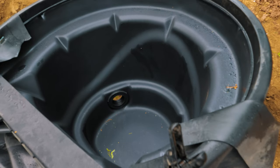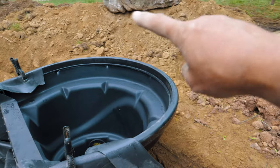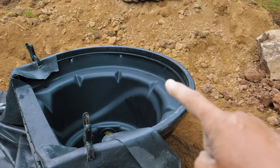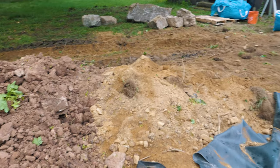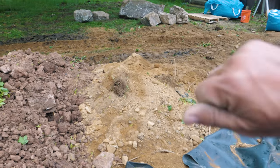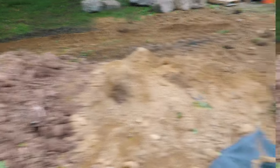How we're going to solve that is split the plumbing into two parts. I'm going to have a two-inch pipe going into the bottom, and I'm actually going to dump a pipe on top — I'll hide that with some rock work, but that's going to give me the flow I need to create the waterfall. Back here I'm going to create a manifold with two ball valves and an irrigation box over it, keeping it nice and neat. I can control the flow of how much goes to the bottom and how much goes on top. I'd like to see about half that water go up through the filter, going up through it nice and easy, with great contact time — and it's going to do a good job of keeping this pond clean.